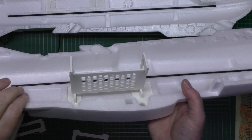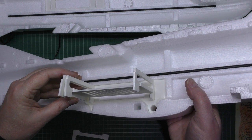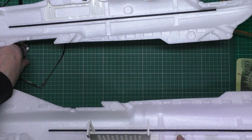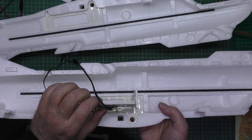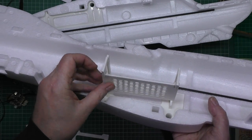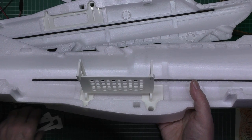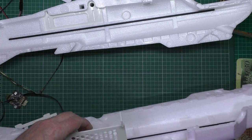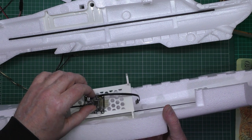So as you can see, that's now in place. The original one is only about half an inch lower — just enough to clear the Naze, because it was actually touching the canopy before, but it's not anymore. The shelf itself you can glue in or leave loose — I think I'm going to glue it or put some bands around it to hold it in place. It's level, and it makes things a hell of a lot better because I can mount the Naze on top and have much better access to the USB connector.